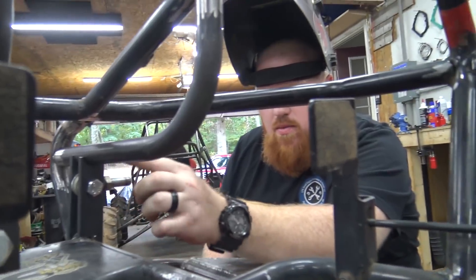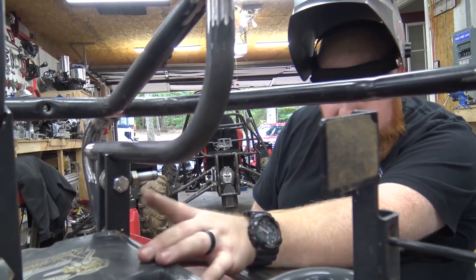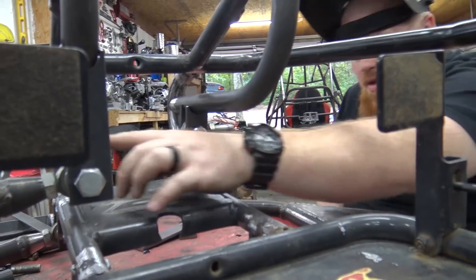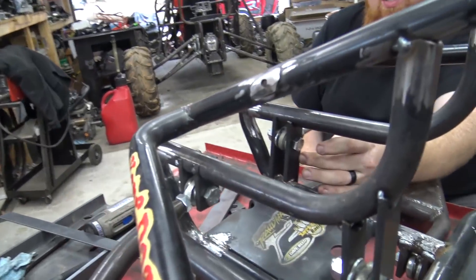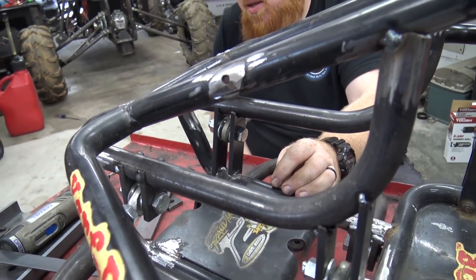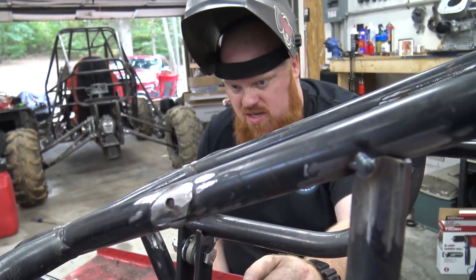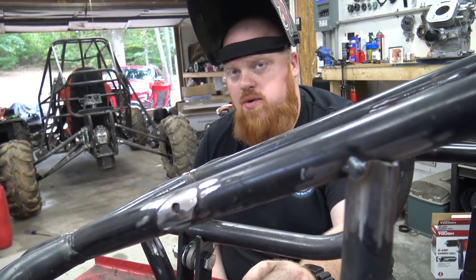I've made these tabs to go from this tube down to this tube just to give it strength. Like I said, we just did these ears hanging down over here and I did not like that. So we can break these tacks now and replace this one with this style that goes straight up and down - should give it a lot of strength. We do have a gap right here to weld. I cut this a little high, but no problem. I can gap weld just fine.